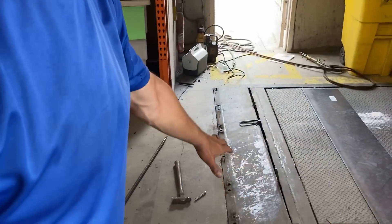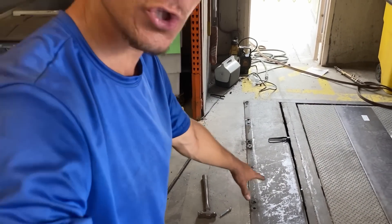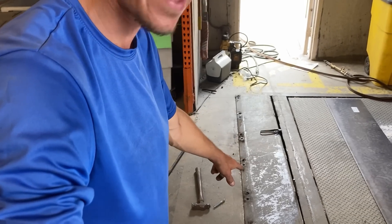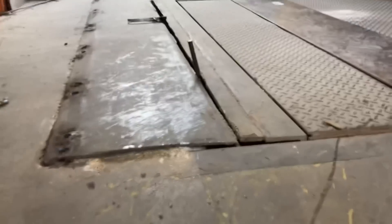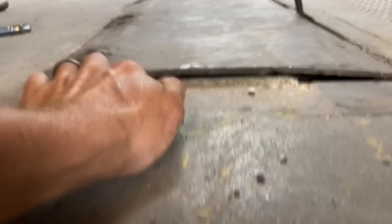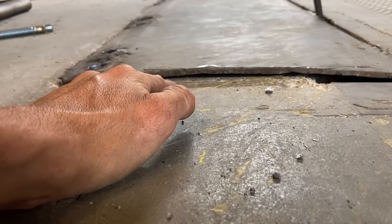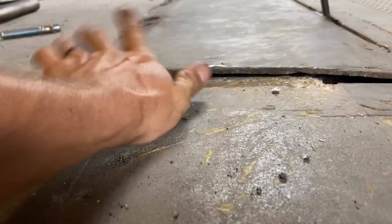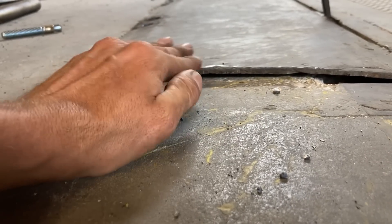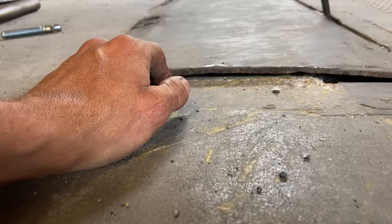So I go ahead and I got this thing all back into place — we've got our new holes drilled. The reason we couldn't use the old holes is because the old redhead is going to be below that and I can't drill through that, so we just need to move over a little bit. But if you look here, you'll see there's this arch — we want to eliminate that. The only way I can think to do it, besides sitting here with a torch for 17 hours, is to drill another hole right there and put a redhead in, then weld it, cut it, grind it, and flush it out as best we can. Hopefully nobody can slide a forklift underneath this after we're done.